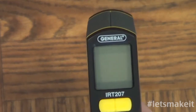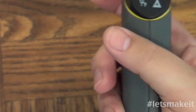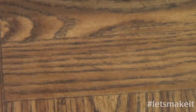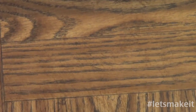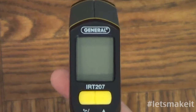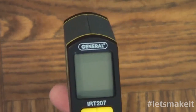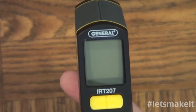And part of the reason I'm going to look at a reflow oven, making an oven out of an old oven that we don't use anymore. So I think that's pretty much it. You're just going to see me go through and put solder down, and I'll show you after I get the solder down what it looks like, and then I'll put the parts on it, and then we'll actually reflow it on the oven here.